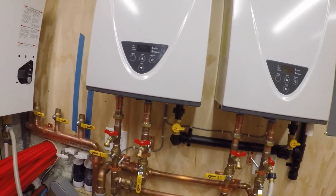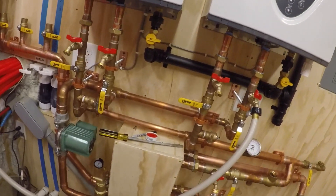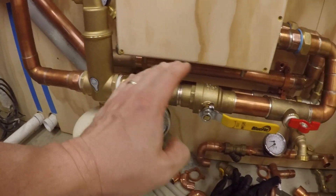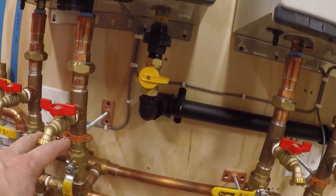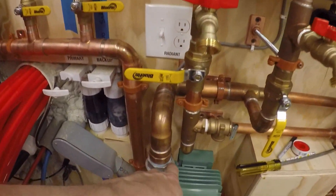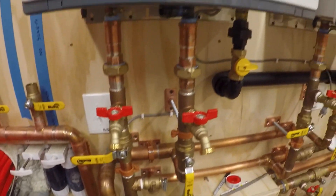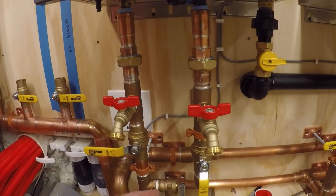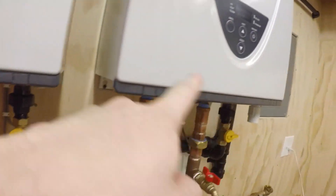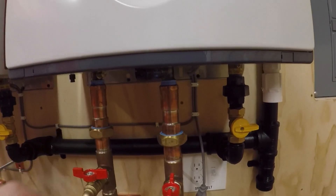I then decided to open this valve up, got the tank on, and pressurized everything all the way up to these valves. I did that and immediately had a leak here around this thread — it was bubbling up out of here. So I thought, why don't I just shut off the hot out and test everything through both of the heaters. I did that and all of these unions leaked.